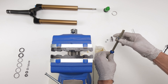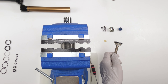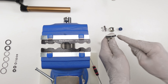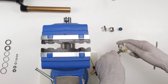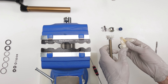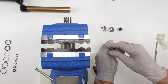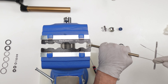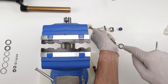We have another seal in here we want to take out. Separate them — we have our seal head and our bumper. Let's start with the piston. We have a quad ring that we need to remove — use a blunt tool or a plastic tool to remove it. That's our quad ring. Let's clean off any old grease, clean the shaft well. We're also going to clean the inside of the threads — use a brush to get that old Loctite out of here as much as we can.